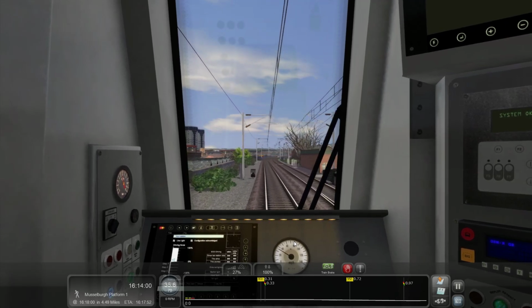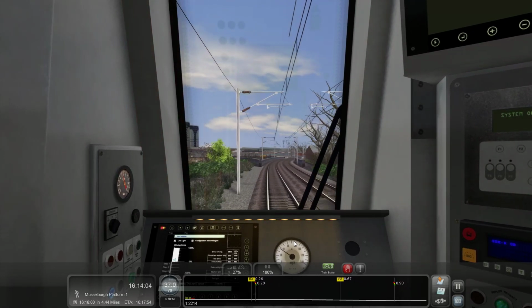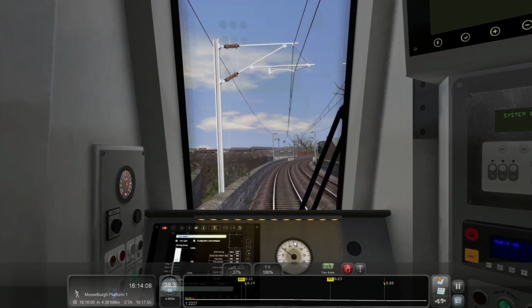To exit the cab seat, using your legs, push back and allow the seat to pivot rearwards. Swivel the seat anti-clockwise and exit the seat. Return the seat to the forward-facing position and lock in place.